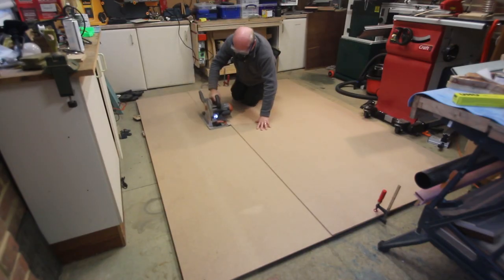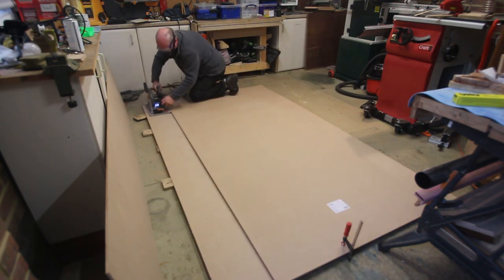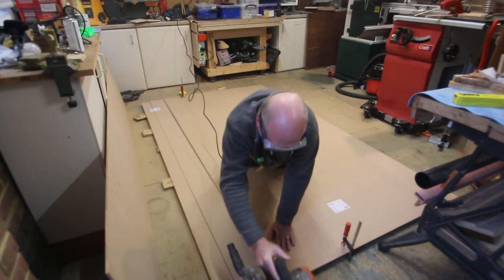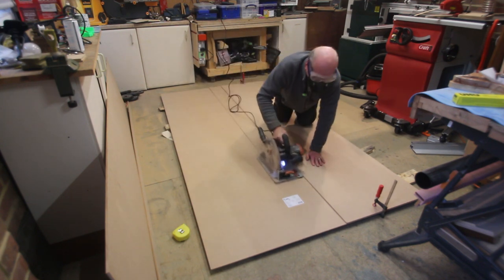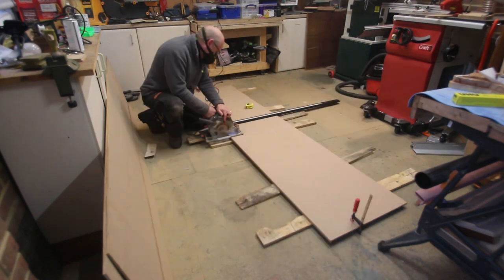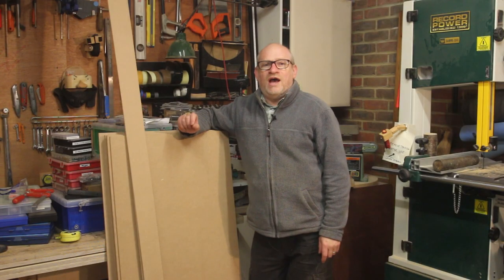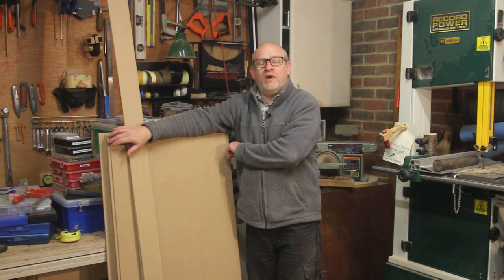My first job is to get these sheets cut down into something a bit more manageable. I'll lay some old pallet wood on the floor to raise the MDF off the floor. I then use the other piece of MDF as a long straight edge which I'll need for the circular saw. These long pieces have been cut to be slightly wider than they're needed. They'll be trimmed to size once the pieces are of a manageable size to put onto the table saw. I have two boards here clamped on top of each other and I'm cutting these in two. I've now got eight four-foot boards that are just a little bit wider than the internal width of the cupboards.